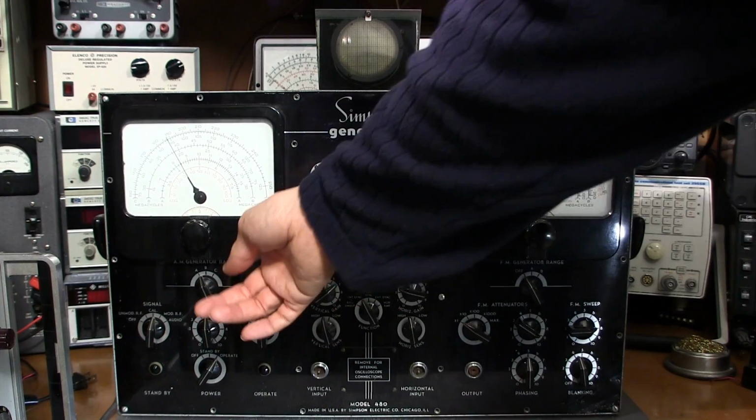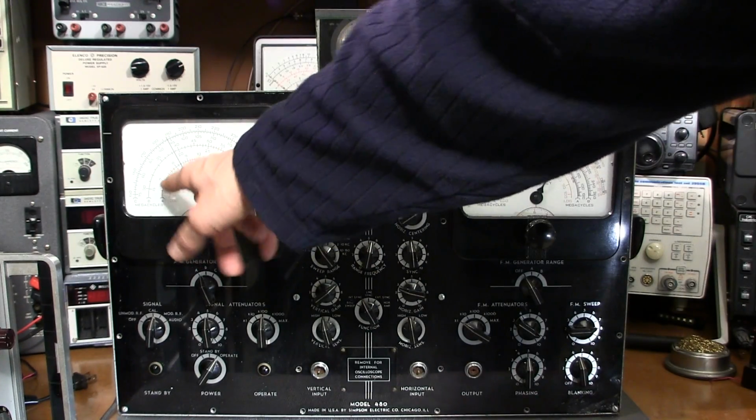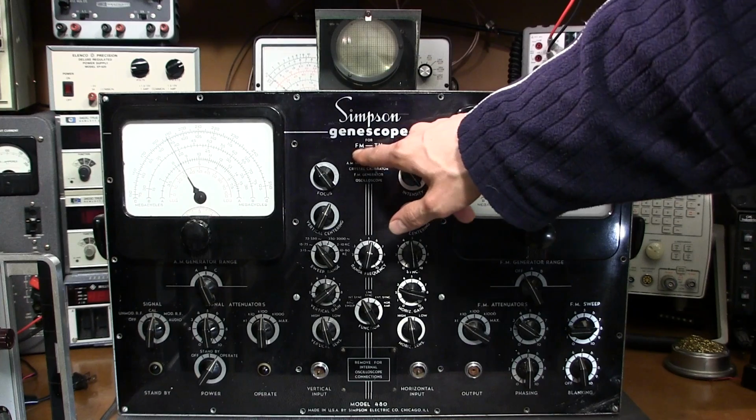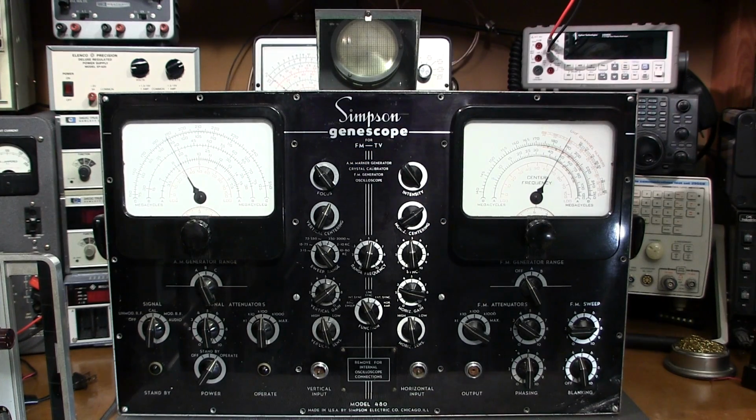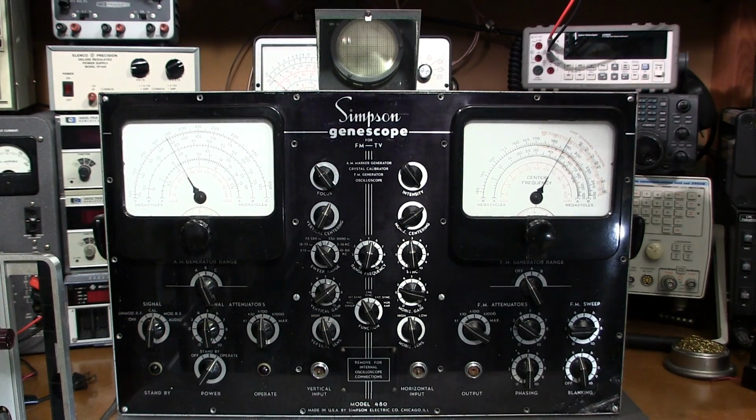Why not give it one extra range and have it go right below the AM broadcast band, so that you can have through the broadcast band, through the 160 meter band, right up to the bottom end of the 80 meter band here. And then you could have called this thing an AM, shortwave, FM, and TV alignment tool. Why wouldn't they have done that? It really is just one more selection on the switch and maybe another coil here. And they would have probably really cleaned up.